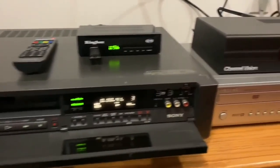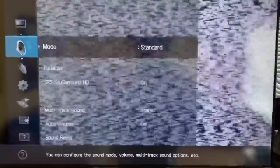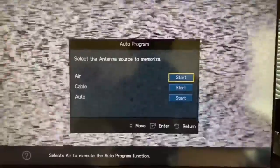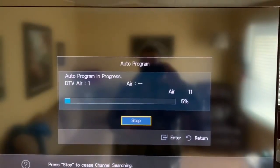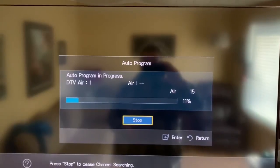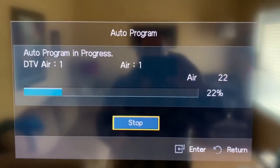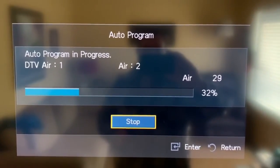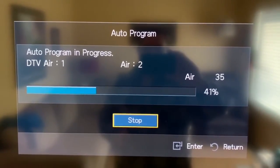Let's go up to the TV in my living room and run a scan so you can see my home cable system in action. Here we are at the TV — I'm going into the menu to run a channel scan, though how my TV works might be different from yours. I've got 'air' selected because that's what you select for antenna. The DTV air channels are the digital channels I'm receiving with my antenna, and in the center where it says 'air one,' those are the analog channels. All the channels on my UHF modulator will be scanned in as analog, so I'll have a combination of digital and analog channels on my home cable system.